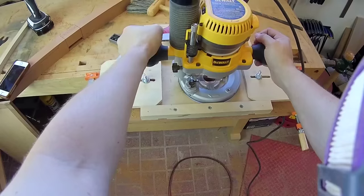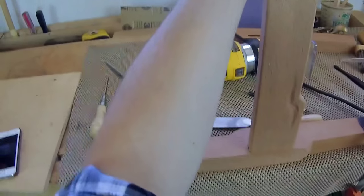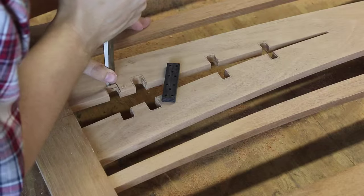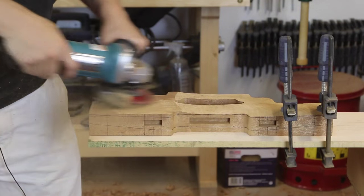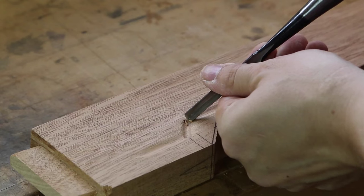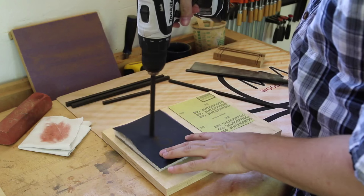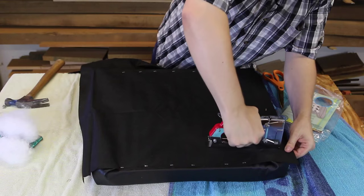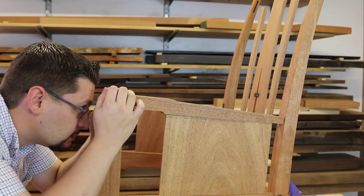You'll learn a wide variety of woodworking techniques from angled joinery, house mortise and tenons, how to make these beautiful rockers, inlaying sterling silver and ebony bars into the center back slat, carving the crest rail, relief carvings in the arms, all of the rails and stretchers, as well as the rockers, how to create ebony plugs and install them into your chair, how to upholster and create the seats, and we'll also create the panels and install them so they fit in our arms and our rails.